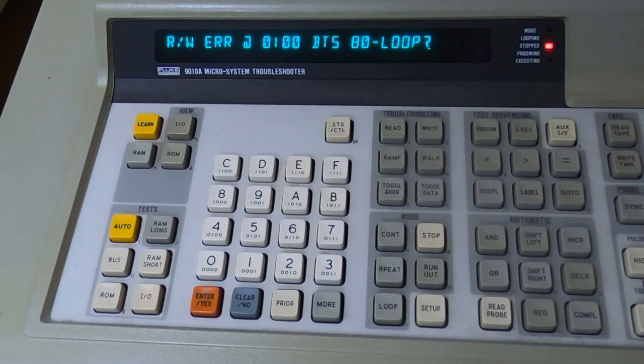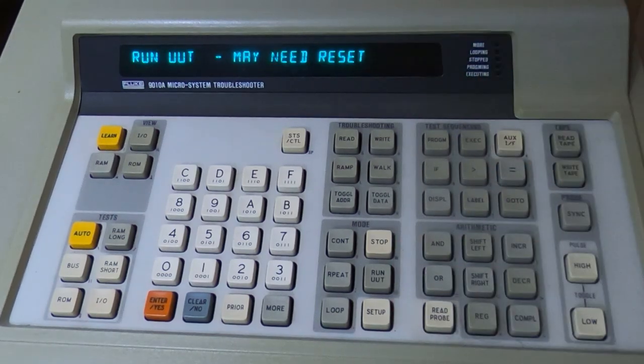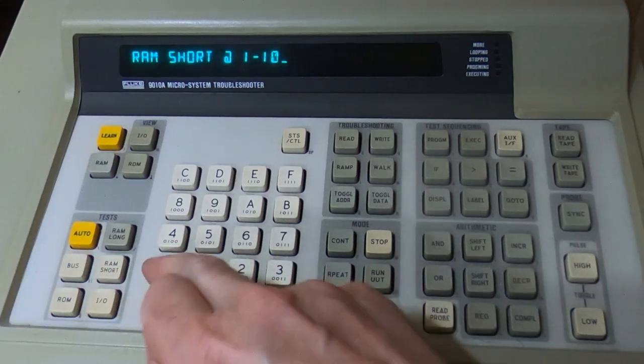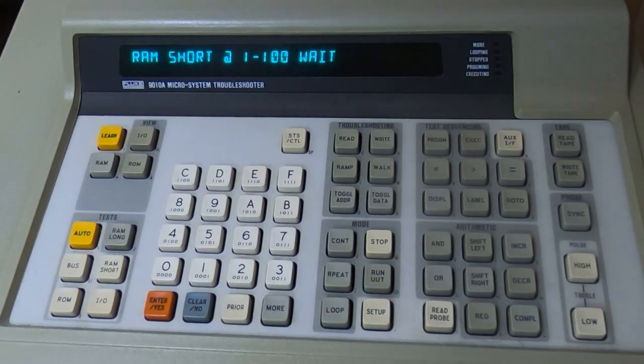Kind of strange, but I'll get the bit-7 RAM chip replaced and see if we can get further through the test. So I've replaced the bit-7 RAM chip and we'll try the test again — a short RAM test from 0x01 up to 0x100. If you recall, it was failing at address 0x02 before. Now it's passing. What I'll do now is plug the system back together, run through the full memory range, and make sure there are no further failures. If all tests pass, I'll plug all the boards back together and try to boot it up.